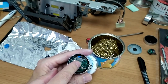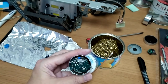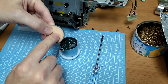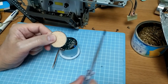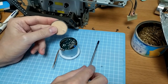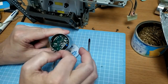The next part is we've got to cut a new piece for in here — I said it was probably going to be made out of cork, but the cork turned out to be too brittle and just falls apart. I did have some thick felt, so I've decided to use that, and I think it actually approximates the thickness much more closely. I've put a small cross-cut in it so that a screwdriver can still go through to get to the adjustment pot.